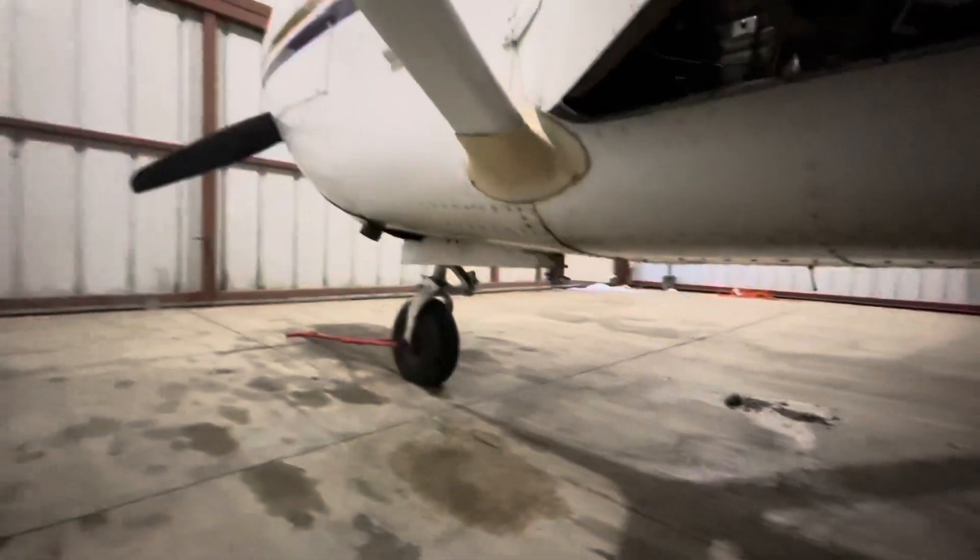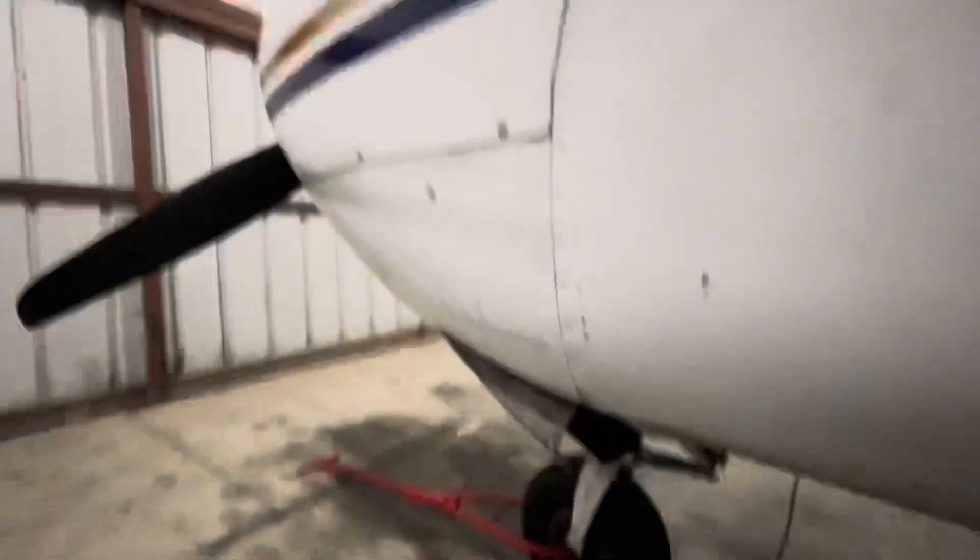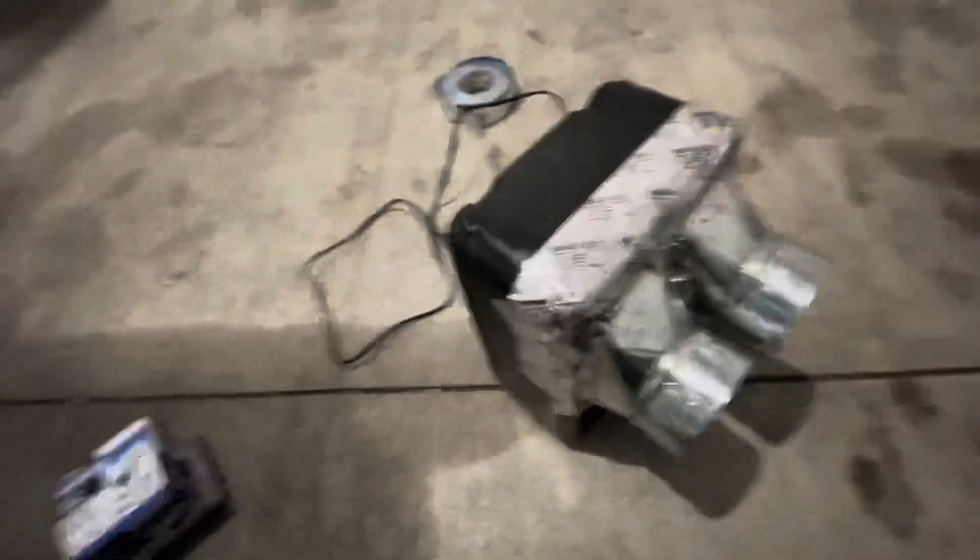All right, here's my thought process. I'm going to come in here underneath the airplane — I have these two cowl flaps. This is an old 1960 model. I'm going to come over to my cowl flaps and open them. Now the cowl flaps are open — it opened these two ports in the bottom of the plane, one on each side. So I'm going to take my heater with the two dryer tubes and run them up in there to heat the engine, sticking one right by the exhaust on each side — and that's what will heat the motor.